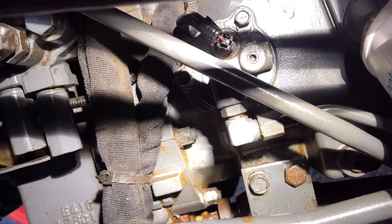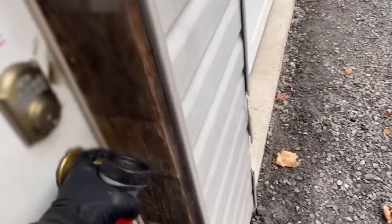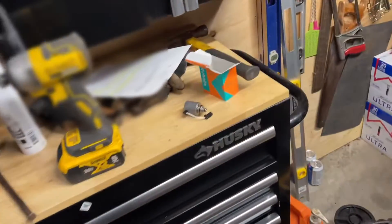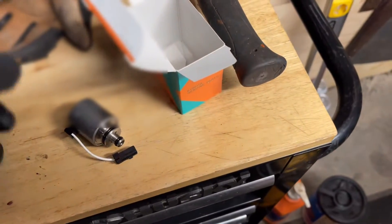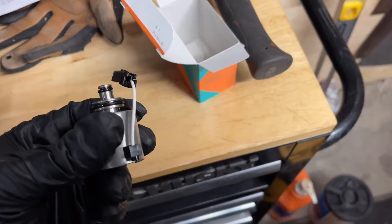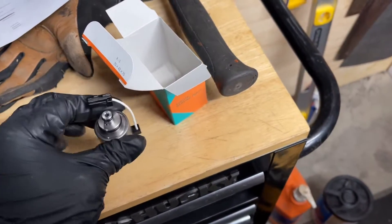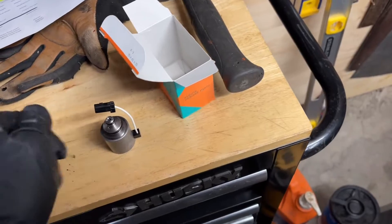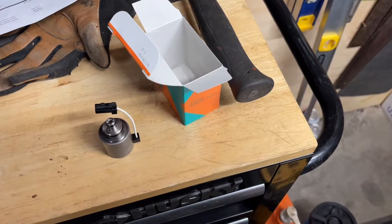You can get technical and check if there's hydraulic pressure in there, but chances are that's not your problem. What I've done is pulled that solenoid out already and freed it up — I had to hit it with a hammer, tap it around a bit, pulse it with a wire on a battery for quite a while, just tapping ground and power to the connector. That is what controls your hydraulic flow. Anyway, it's working right now since I freed it up and pulsed it with some power, but this is what we're going to replace and I'll show you how to do it.